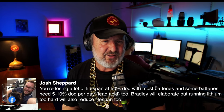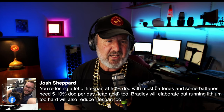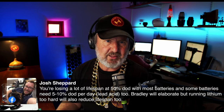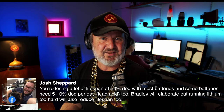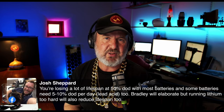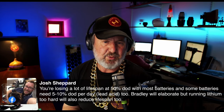You're losing a lot of lifespan at 50% depth of discharge with most batteries, and some batteries need 5 to 10% DOD per day. I should point out that 50% depth of discharge is over the days of autonomy. Now, I chose 5 days of autonomy, so that means 50% after 5 days, not 50% every day. So definitely agree with you, Josh. 50% every day would be tragic for a lead acid battery, but over 5 days, it's only 10% per day. So that's an important consideration.